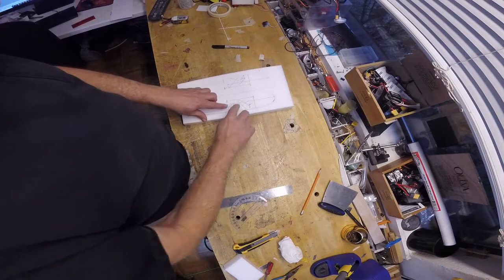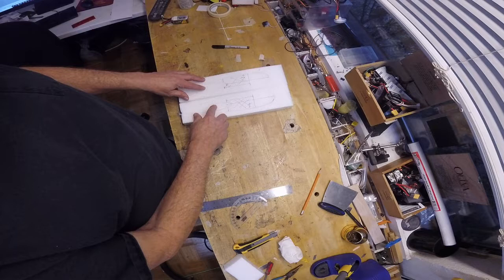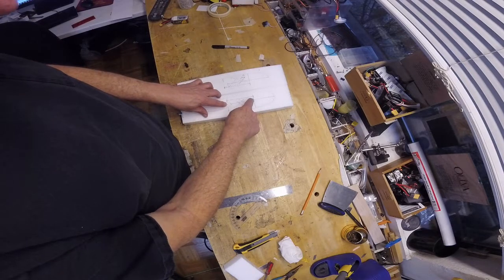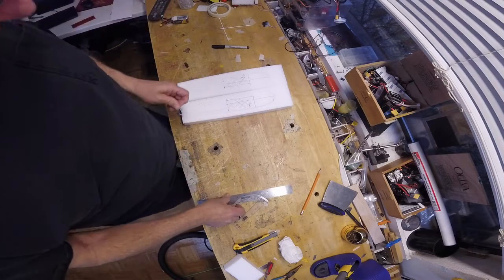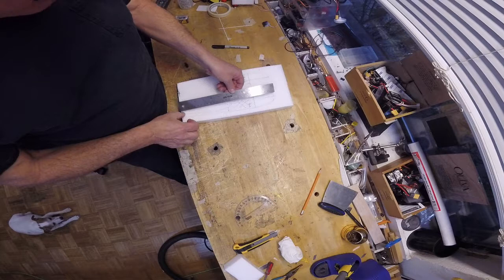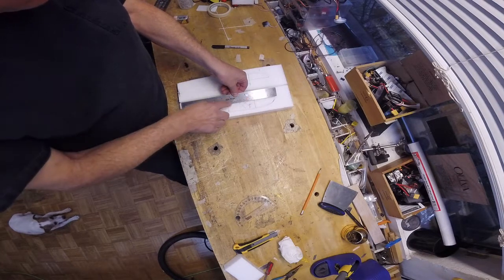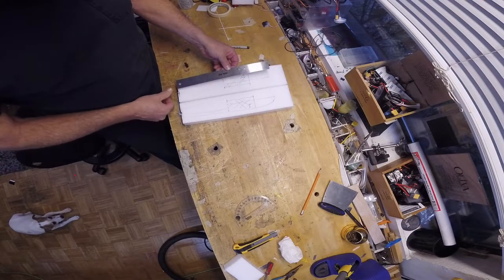And this starts at a 1/2 inch back from the leading edge. I'll lift the pieces in here. And it goes 3.5 inches, and then it's 1.5 inches down from here. It's on the plans. So the easiest way to do this is to take a straight edge and go from the center to there, draw a center line, because you're going to need that center line anyway to cut out for the cam as well.